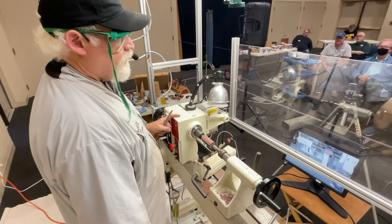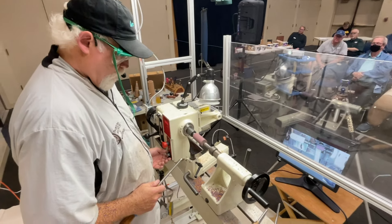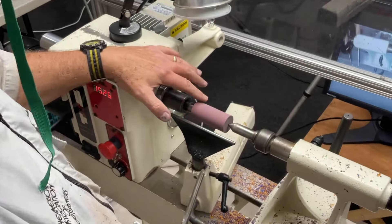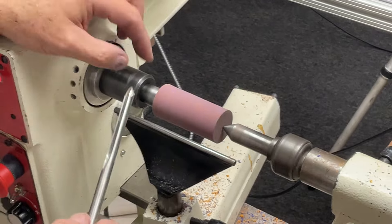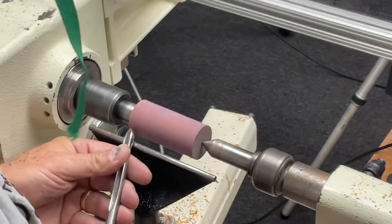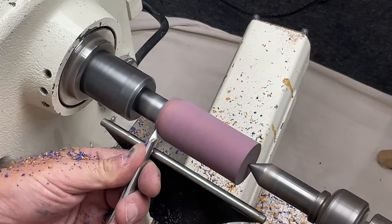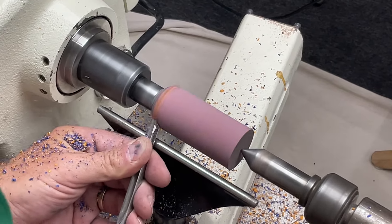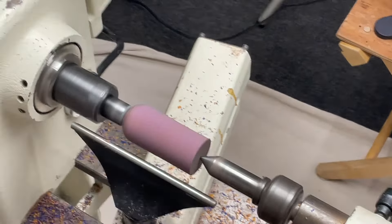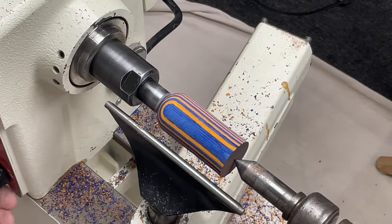Just play around and you might be pleasantly surprised. What I usually do is approach it from both ends and blend from the middle. I know this end is going to be the bottom of my mushroom, so I want it to taper or end up rounded so the bottom diameter of the mushroom pretty much matches the diameter of the mandrel. I come at it and round it — I may make the diameter of this bottom smaller later, but for now I just want to get it there. I'm pretty comfortable with the proportions as a starter.